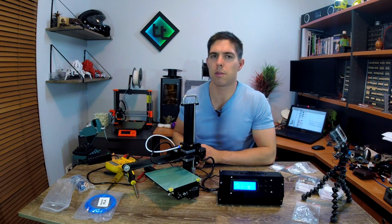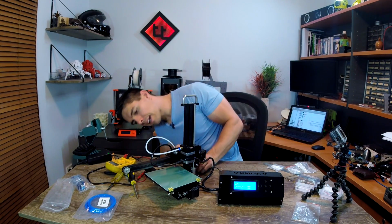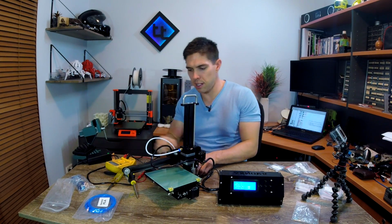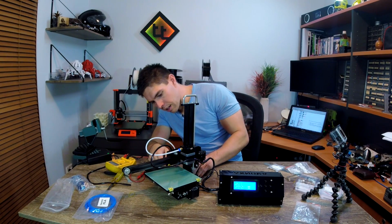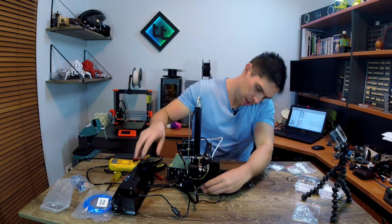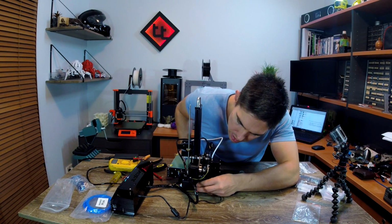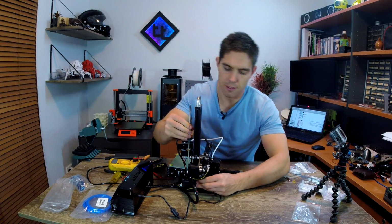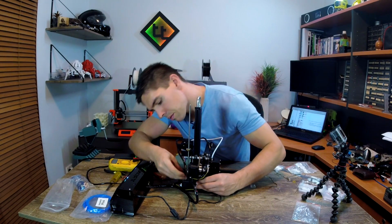All right, I can already see there was no specific instruction on where the stopper should be for the Z axis. So I'm already way below where I should be. I'm going to hit the switch manually and then loosen that bolt and slide it up a lot higher. So on the back here is our Z end stop. And there's quite a lot of room to slide it up and down. I suppose that's how you tune the starting height.